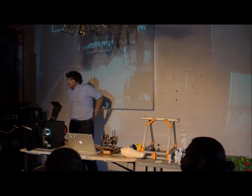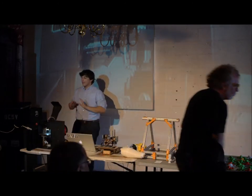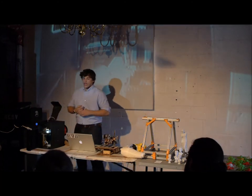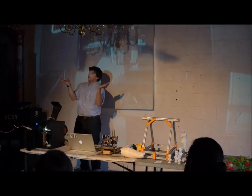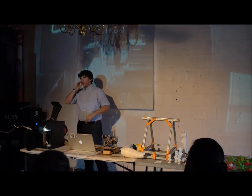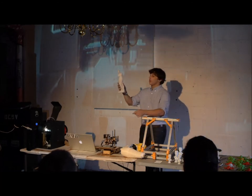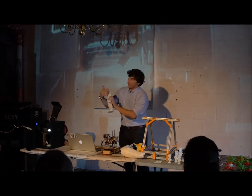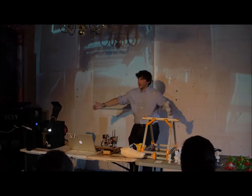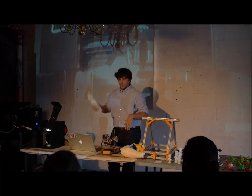Size is definitely a limitation. This printer has a maximum build platform of 4.7 inches cubed. This other one is about five by three — kind of postcard-sized. Larger printers have bigger build platforms, but then you encounter that curling problem where the material curls on the edges because it doesn't cool properly. For something like a sword, you just section the model and print it out in pieces — this object here was actually five pieces later put together. You can use acetone to weld ABS pieces together, or just use super glue like I did for this one.